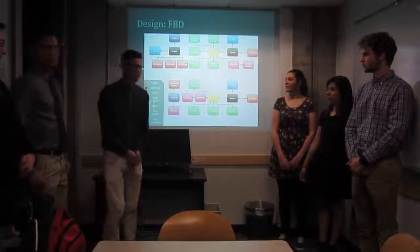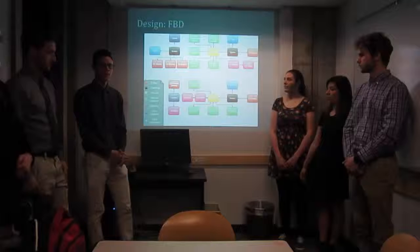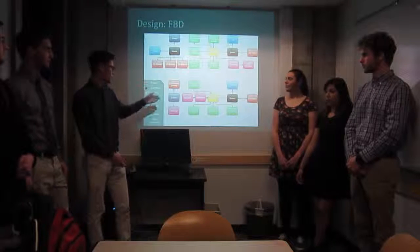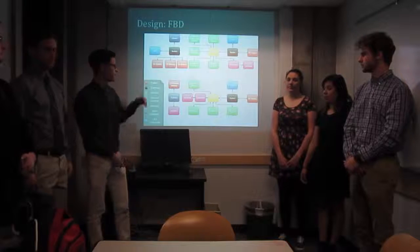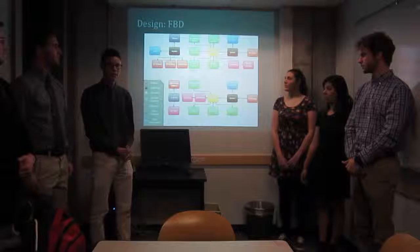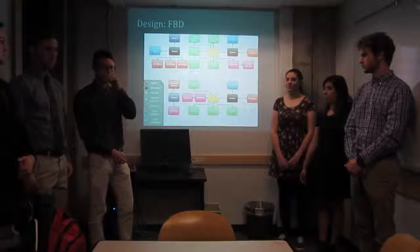For our FPD, on the top left we have our heater, which is powered by three 9-volt batteries, and we control it with a switch, and we have an LED light to tell the status of it. We have our camera, which is powered by a lithium-ion battery, and it has an SD card to store the images. Both of our Arduinos are set up pretty similarly — they each have a 9-volt battery to power them, their own switch, and an LED light to tell the status.